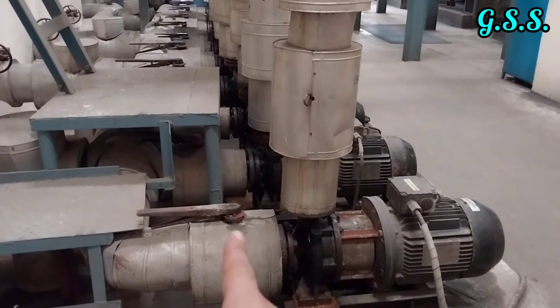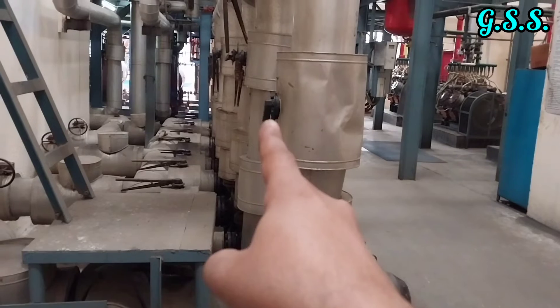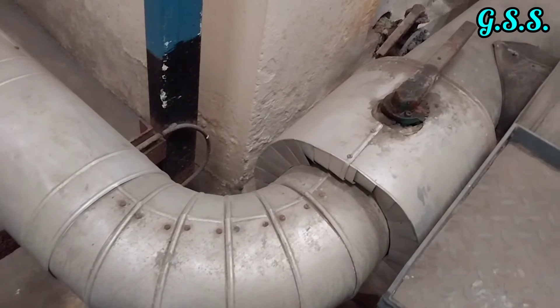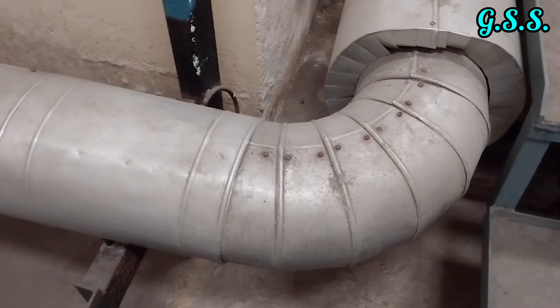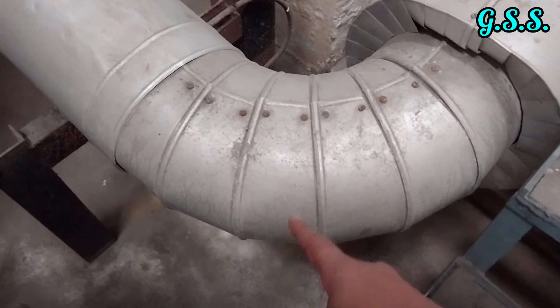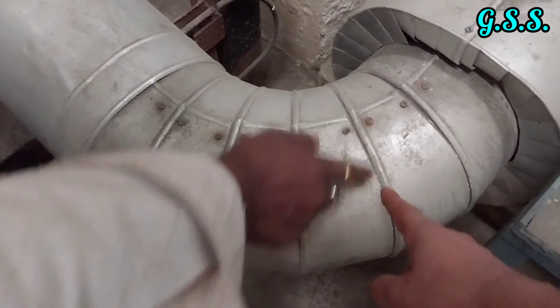Finally, after aluminium cladding, the completed box will look like this. In the same manner, bends are insulated and aluminium cladding is provided in segments having grooves so that water will not be able to ingress inside. These are the punch grooves on the aluminium cladding sheet.